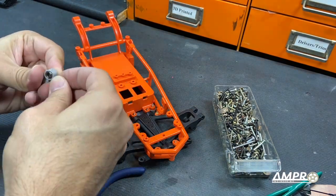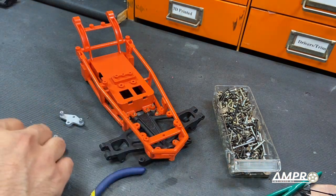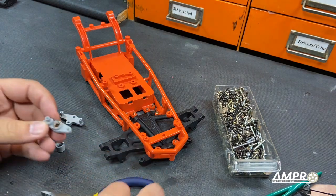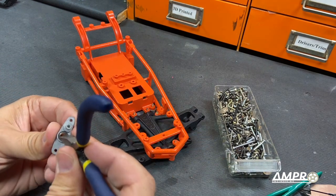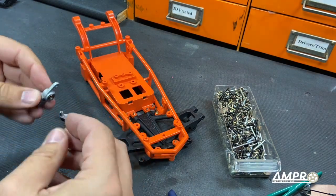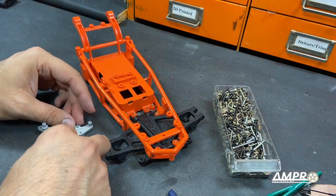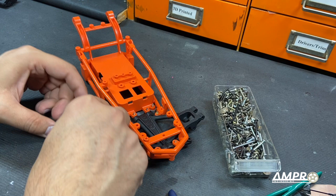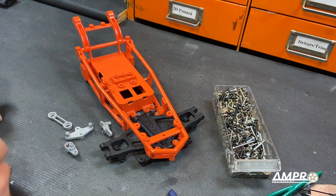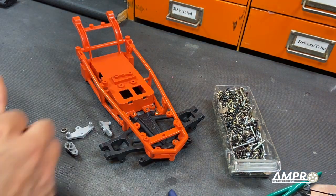And the reason why I did all of these is because A, Ampro, why not? And B, these are 3D printed parts, and it's really going to be impossible to rely on these parts to rub together smoothly. So you're going to have something else that is providing the motion. So that's where all those are going to go. These are going to go here somewhere, and then there's another piece right here which connects the arms, and that is where the other two bearings will reside. I really hope this works. I've only simulated this in CAD.